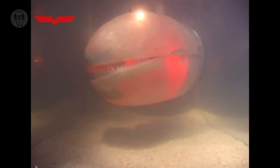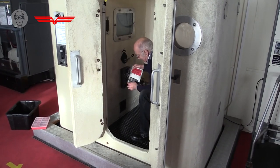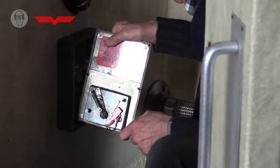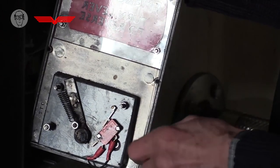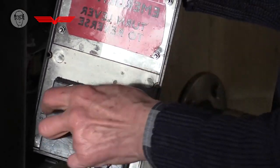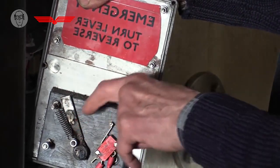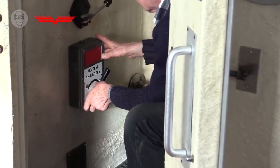It's easy to get a spring a bit wrong. When my bathyscape underwater adventure machine starts leaking, people grab the reverse thrusters lever incredibly hard. It's just a simple thing. There's the spring, but it snapped several times. I think the fatal flaw was that the nut on the end tightened up, clamping the end of the spring, and this creates a stress point, which is where it snaps. I should have known better. The ends of a spring must always be free to move about.